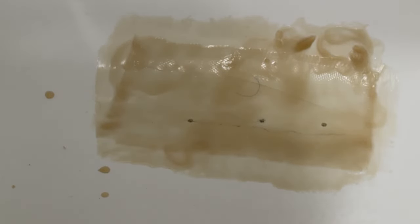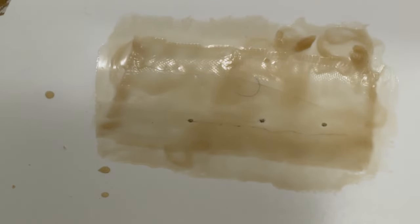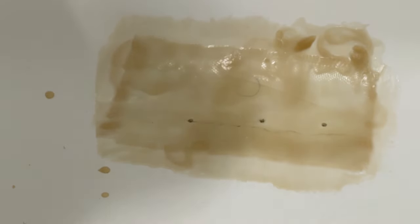The next part here is take the 80 grit. Where is this 80 grit thing here? Here it is. Take the 80 grit sandpaper and go back across this, rough it up, get it somewhat smooth. I'm going to take these little blotches out. I don't know if the camera's getting it, but there's a couple blotches here where I had the paintbrush and wasn't really paying attention.